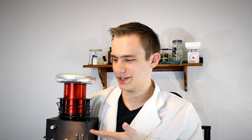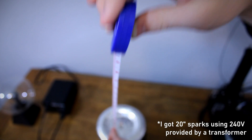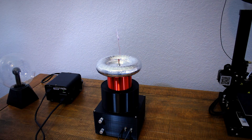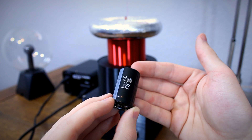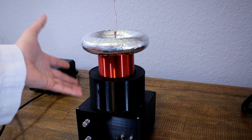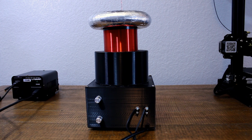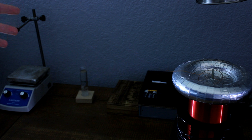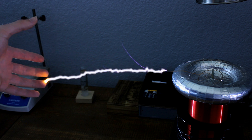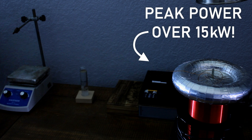In my mind, this is the best solid-state Tesla coil I've ever built. It's quiet, compact, efficient, and produces ridiculously long sparks — over 20 inches, from a tiny 5-inch coil, meaning the sparks are over four times the coil's length. The new circuit also doesn't have any large bus capacitors like most other solid-state and dual-resonant Tesla coils, which cuts down cost quite a bit. The ramped sparks are remarkably quiet despite their length, and the coil's palm-top size makes it a great fit for an indoor Tesla coil. Using a super low-value shunt resistor and my oscilloscope, I calculated the circuit's average peak current to be around 50 amps. With peak voltage near 350 volts, the system's peak instantaneous power draw is over 15 kilowatts.